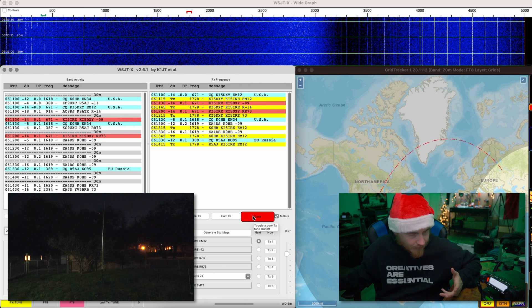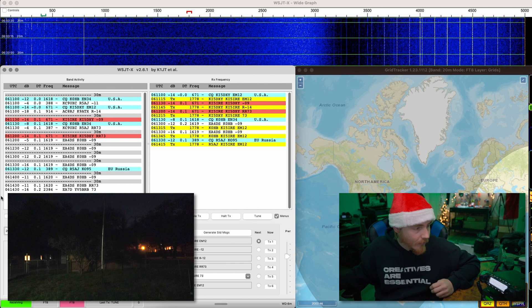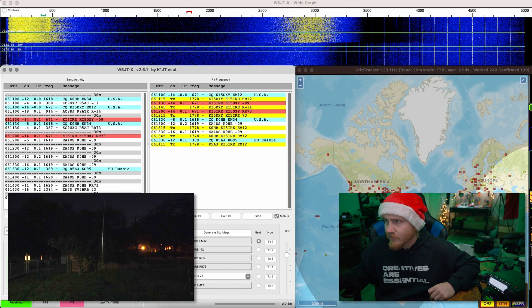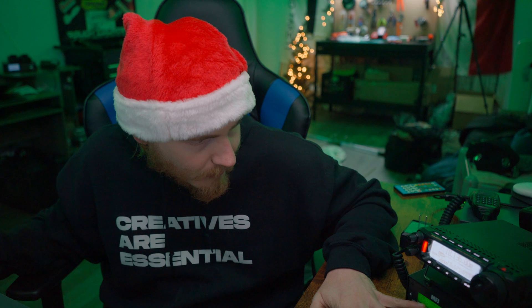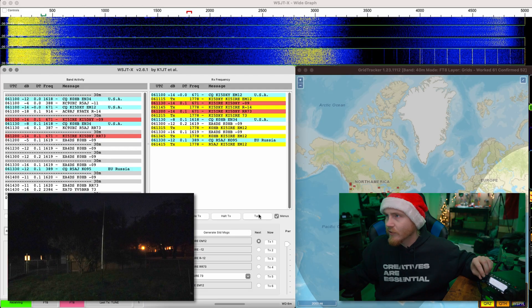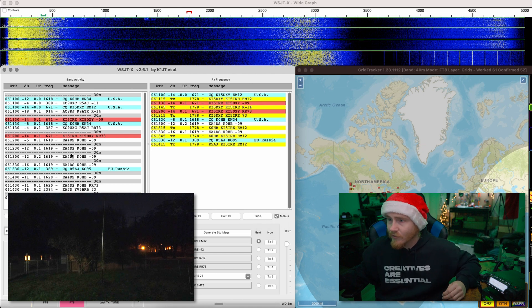I already made one contact before I started filming — a guy about 15 miles away. The tuner is currently tuned to 160 meters, but I'm going to show you this thing actually tunes right up. Hit tune — that tuned right up, showing 95 watts out. On 20 meters it sounds dead, so let's go up to 30. Hit tune on 30 — tuned up at 1.1 SWR, putting out 100 watts on 30 meters. I cut this antenna longer than I was supposed to, so that's not surprising. On 40 meters, 1.8 SWR putting out 100 watts — that's not bad.